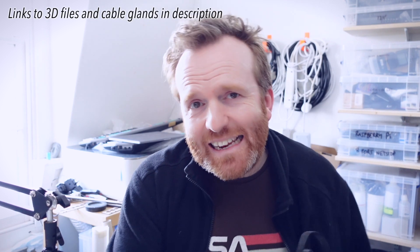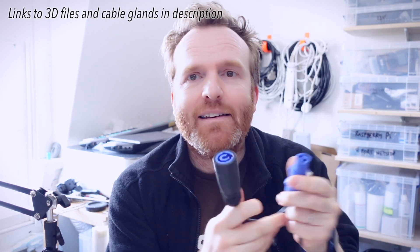It's the kind of thing that if you need it, you're really going to need it. My particular use case is this: I've got a socket going through to a plug, so the cable that powers my lasers — I pull it out and put this in between the cable and the laser. I've got another cable coming out to a 12-volt power supply, and I use these to power my EtherDream laser controllers. It's just super awkward to get a 12-volt jack supply into a laser that's rigged up in a lighting rig. Anyway, quite a quick fun little project!